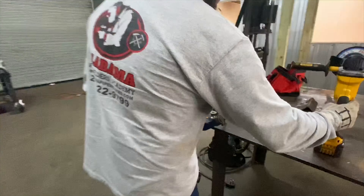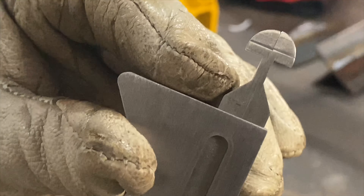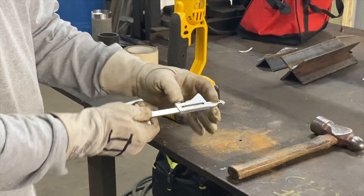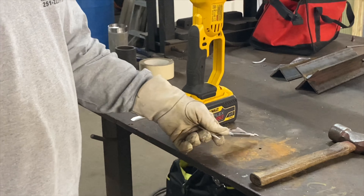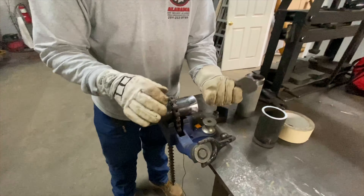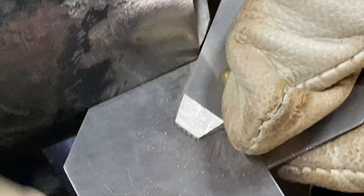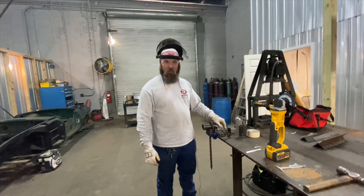There are a few tools you can use to gauge this. A high-low gauge has an angle of 37 and a half degrees — you put it in, pull it back, let it rest on the bevel, and if it's square there and touching the bevel, then it's 37 and a half degrees. There's also another tool — like a mini cam gauge — where you lay it flat and you can see. For example, this one's already beveled on one side at about 50 degrees, and that's what not to do.